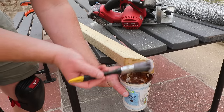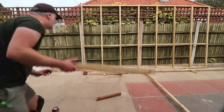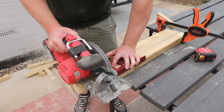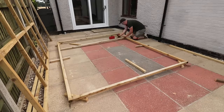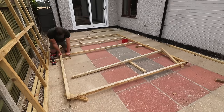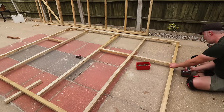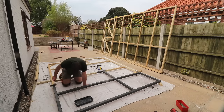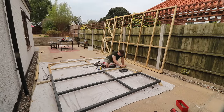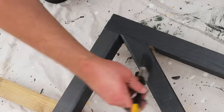A bit of preserver, and then I can fix the braces in place with a couple of screws. With the door done I can do a bit of maths to figure out the best spacing for the uprights on my second wall, allowing for the door plus a few millimeters either side for clearance, and then I can frame it all out. These uprights were spaced 605 millimeters — a bit wider than the 530 millimeters I used on the first wall, but that really doesn't matter. At this point I'm going to paint the walls with some leftover dark gray garden paint. This is the same paint I used on the pergola, the garden table, the outdoor sofas and the coffee table, so it'll match everything nicely.